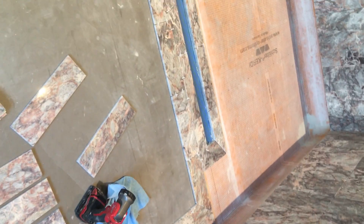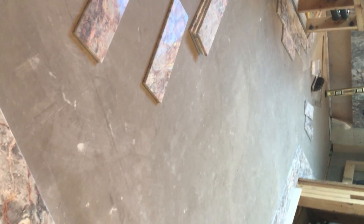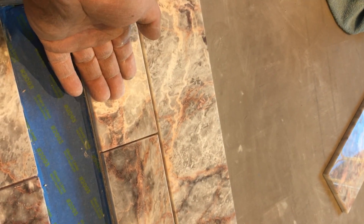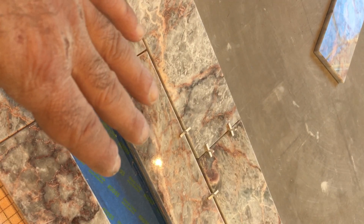This is how that linear drain gets framed out. You can see there's some back pitch to this side, slightly on this side of the glass. If you're using a handheld and water is getting splashed onto the glass from the handheld or body jets, it's going to hit the glass, run down, hit this tile border, and then plane into the drain. That's why it's back pitched — if you're level or tip the other way, you're going to hold water.